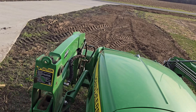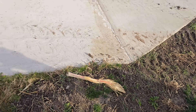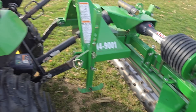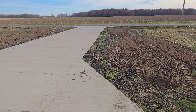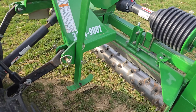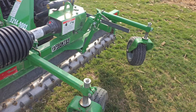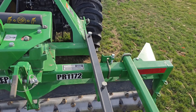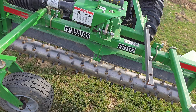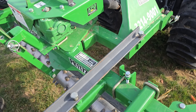So we have for the day a rented 2032R with a Harley rake, and we got a little learning to do to figure out how this thing's gonna work. Basically we're gonna use it to grade off, smooth off, and clean up the dirt that we piled in here the other day, and get it ready to plant some grass. It's got a drum there that spins on the PTO shaft, with gauge wheels on the back. There's an added piece of angle iron that keeps it square — you can actually turn it so that it rakes stuff off to the side.